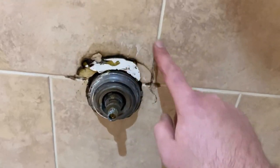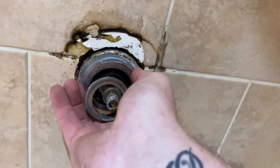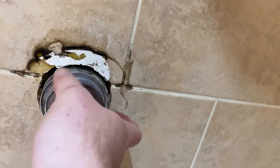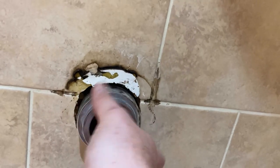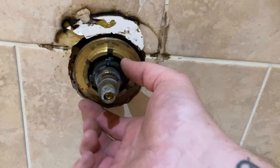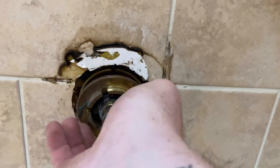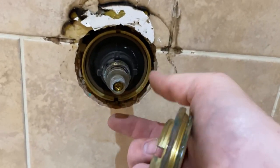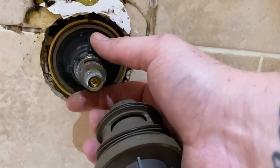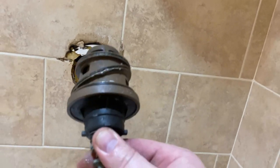So we've taken the handles off, took the shroud off from the outside, and then hopefully if we unscrew this we should be able to get in there. We've unslackened this off — this is like a retaining bolt — so if you undo this, there's the valve there, and that should just pull straight out. With a little persuasion, and I've got a head full of water, that valve just comes straight out.